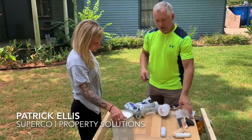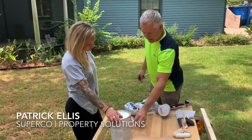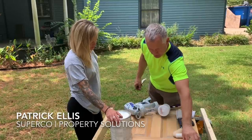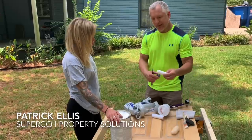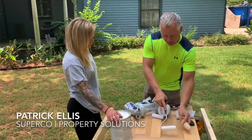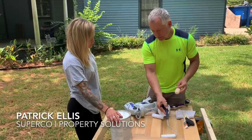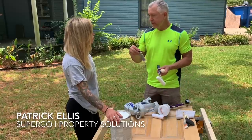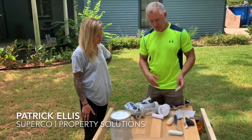And so in your case, because the door has some intricate detail, you're going to likely do roller on all your flat surfaces, like here and here, and then brushing, here's a flat surface here, and then brushing inside of these. Now, with one of these rollers, you can roll a lot of this, but it gets a little messy when you get into the corners here, because you can actually dab these in the corners and cover those spots, but it gets kind of messy, and having a brush to kind of pull some of the excess away is a good idea. So, like I said, in most cases, you're going to do a combination of both.